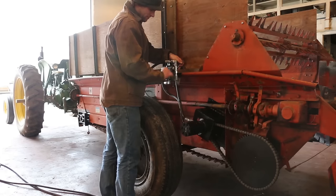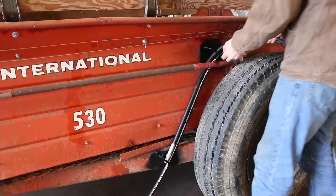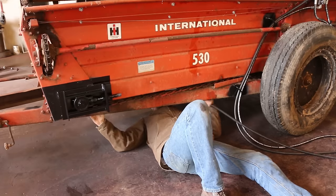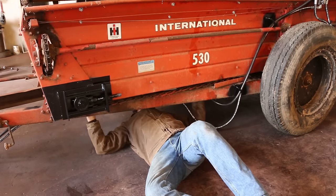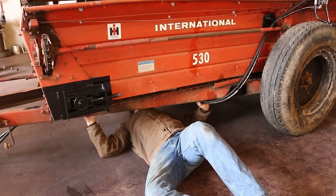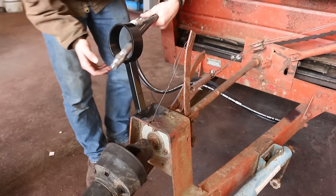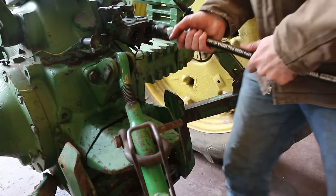And then I started sticking all the components back on. I was getting pretty fast at putting this hydraulic flow control on by this point. Fed the hoses through the loops for one last time, and then up and under along the inside of the frame. I also welded some tabs in here to hold the hoses in place. For some reason, it's really satisfying to me running hoses in a clean and efficient way. And then I hooked them up to the tractor.